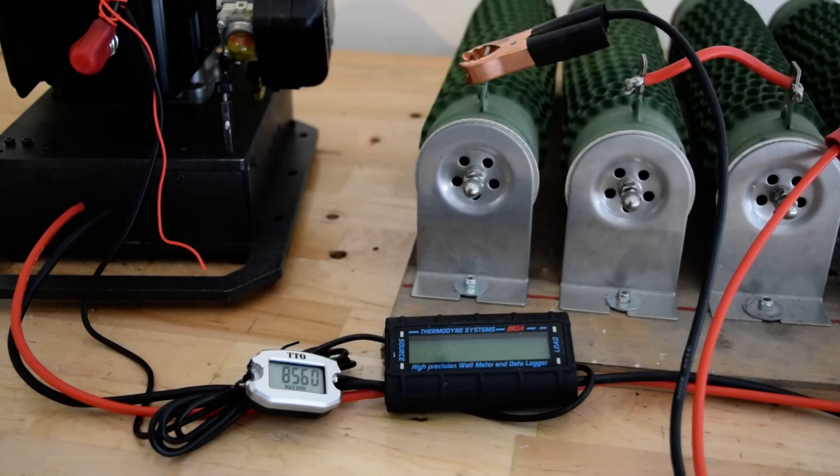So there it is — about 8200 RPM and it was reading about 450 Watt. It's made to charge a 36V, or 12V times 3, battery pack at 350 Watt at around 6000 RPM. That's what it's made for.